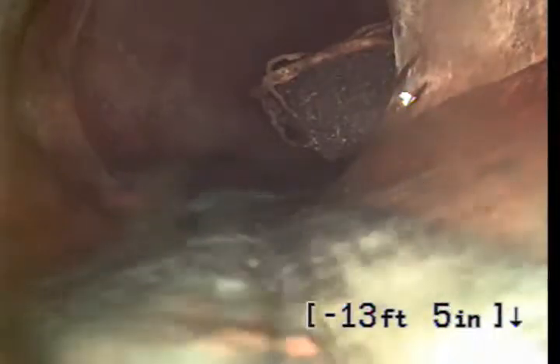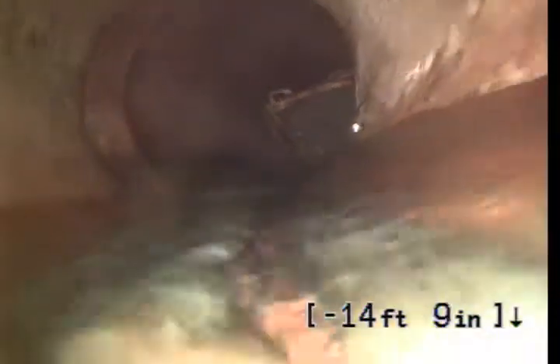We're going to recommend what's called a hydrojet. For the record, I'm talking to my guy up on a roof because there is no clean out. We went down a 4-inch roof vent. Now we're in 4-inch clay. This is typically near the sidewalk, curb area.